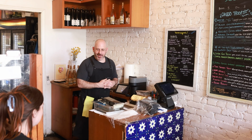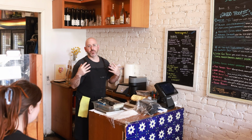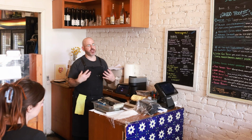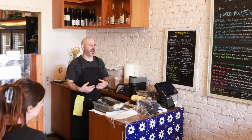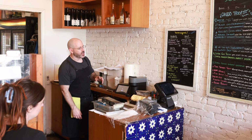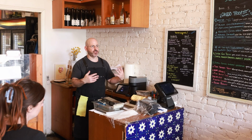Yeah, I'm game. All right, so the cool thing about ceramic stones is the binding agent is also really hard and aggressive, and it contributes to the cutting speed of the stone. They tend to provide really good, grippy, tactile feel, and they are the most common kind of stone out there. So the vast majority of stones you'll see will be like that. They need to be soaked prior to use until they are fully saturated, at which point you can use them. You'll splash water on them as you go.